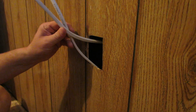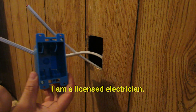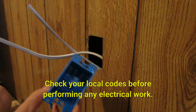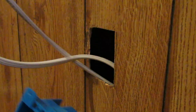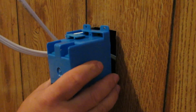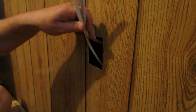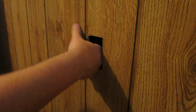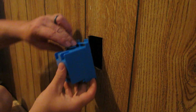Here's the next outlet and the wires coming out of the hole I've already cut. I didn't have the single gang old work box when I started cutting the holes and fishing the wires, so I just kind of guesstimated on the size. I didn't want to go too big, so that's the main thing. I might be just enough wide but I didn't know how tall I needed to be. I need to tuck these wires into the wall — if you have a problem and these wires are going to fall down into the wall, don't do that, try to do something different.